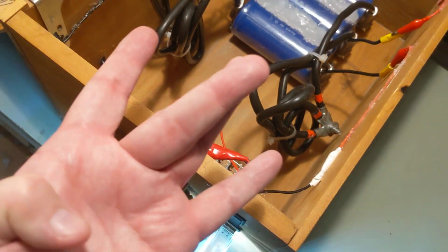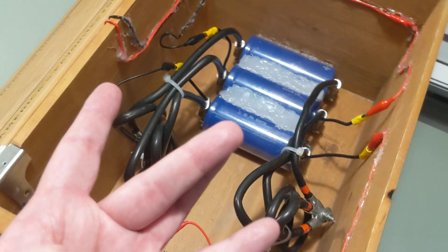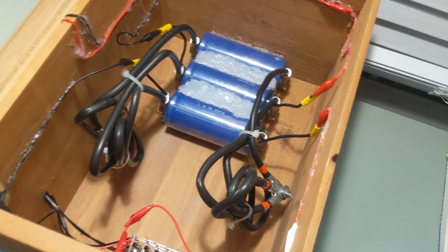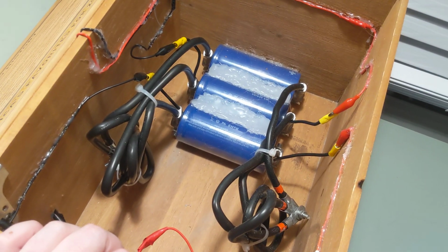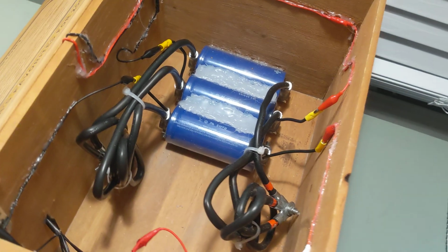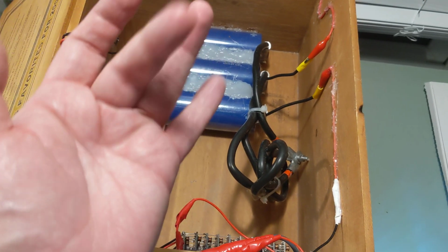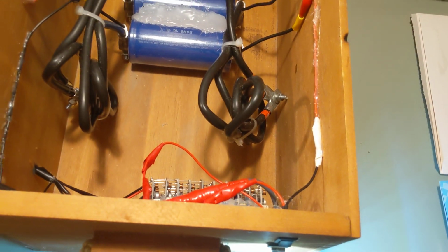And with that, you're only going to get up to 500 milliamps maximum charge, but it's going to work with more devices, because you're going to be running some protocol called, what was it? I don't know. It's like the wall wart thing. Hey, I'm charging from the wall. This is a dumb adapter I'm charging from. So solder together those data lines in the middle of your USB. That's the best you're gonna do.